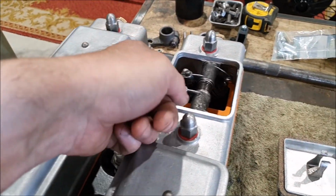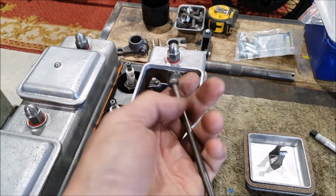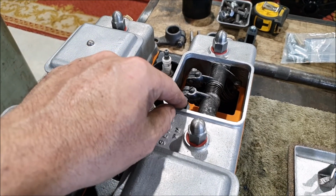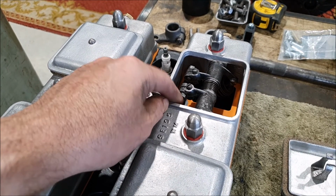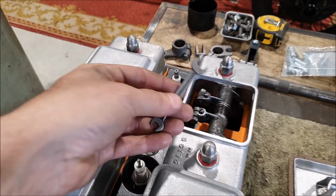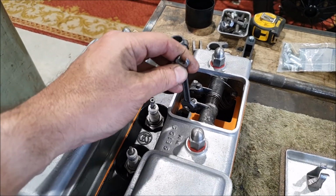But you can see down in here, this is how you adjust the rocker gear. These have little ball ends which match the cups on the end of the push rods, so they'll push up on those. These screws, I believe, are 0BA hex head. I have heard of people replacing these, because what happens over time is the hex gets rounded off, and I've got a nice tiny little spanner that fits them. So you adjust the valve clearances and then you use these to lock things up.